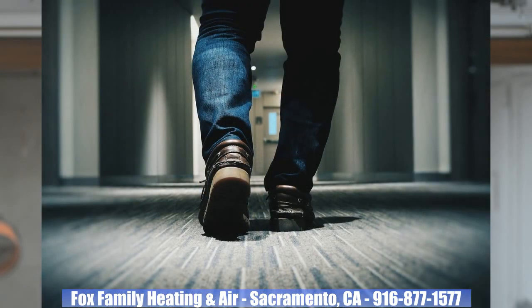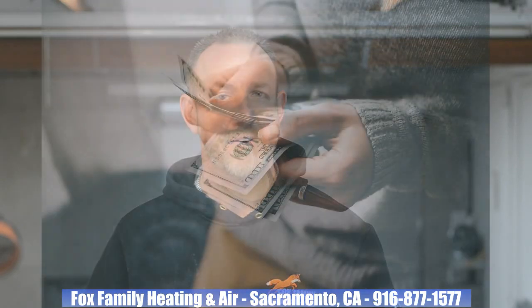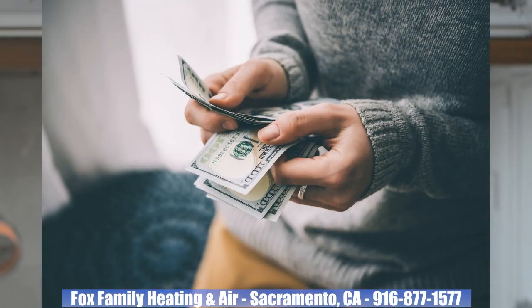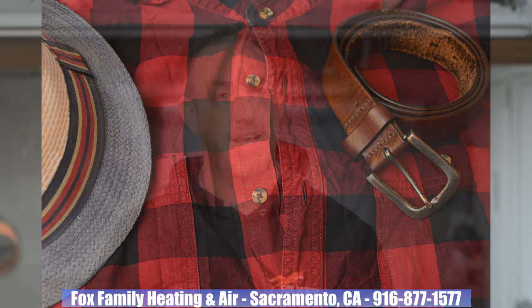Most people don't even know that they're charged with static electricity as they cross the carpet floors and onto the HVAC system of a customer's house until they feel the spark travel from their fingers to the brand new control board that they're changing out. Some of those techs also don't know that they've just damaged that expensive control board their customers are getting ready to pay for. You don't have to be wearing a flannel shirt and your favorite pair of woolly socks to develop static.